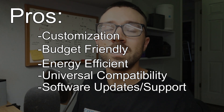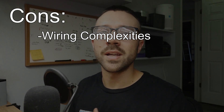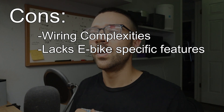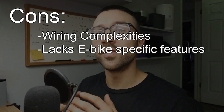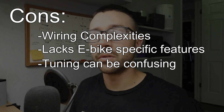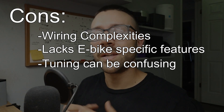Some cons: first, the wiring is not straightforward — you have all these connectors on the board and they don't just say 'throttle,' 'brake,' 'on/off switch' like most controllers would. They're not labeled, so you do have to understand how to do the wiring. Another thing is that this controller lacks e-bike-focused features, so there's no light output or a switch to turn the controller on and off, which can be a pain for people new to the hobby who are still learning about wiring and soldering connections. Tuning can also either go smoothly or be a pain — the setup wizards are great but only get you so far, and if you update to the wrong firmware the setup wizard won't work and you'll have to manually tune the motor.